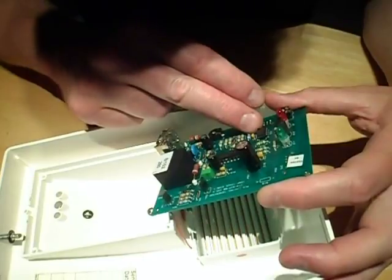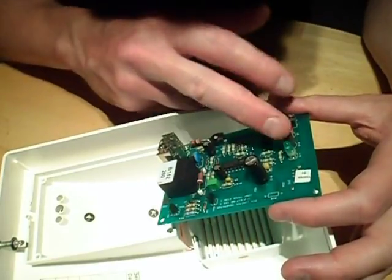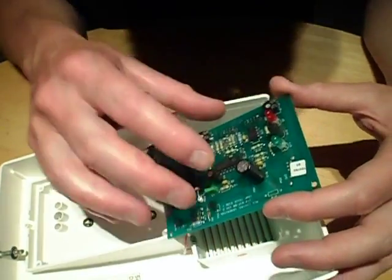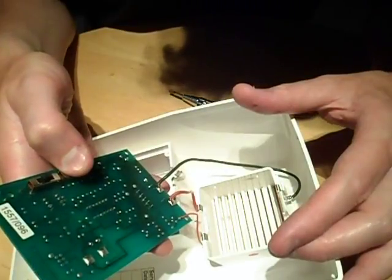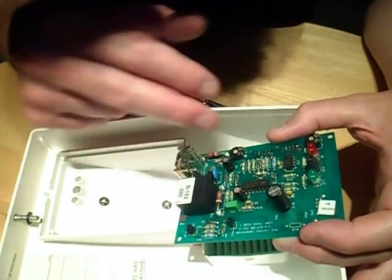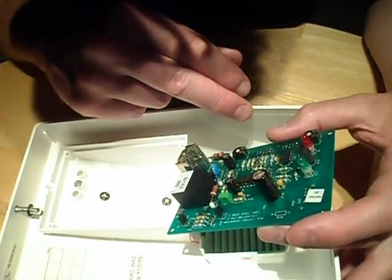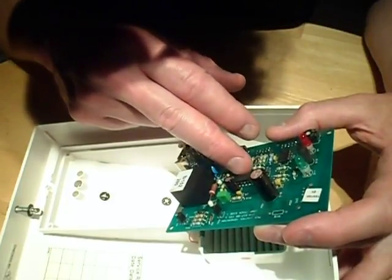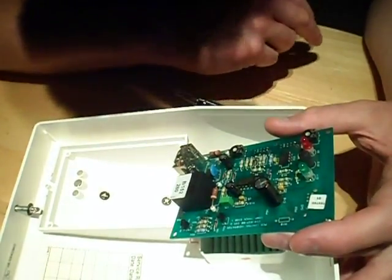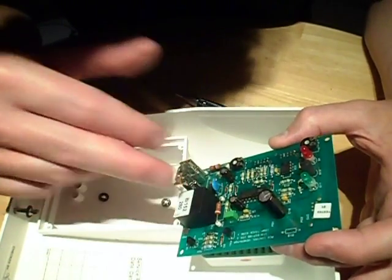Let's take a look at the chips. This is an LM358N, which is an op amp — that must be for the light sensor, with a little bit of plastic sleeving around it. That potentiometer is probably for adjusting that. This other potentiometer — I wonder if that's for calibrating the cycling speed. This chip is an NE556N, which is a dual 555-style timer, so that will be doing the cycling on and off.